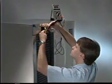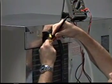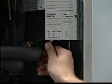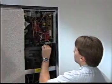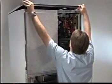The first step in the 10-minute check-out procedure is to make sure there is adequate water and power supplied to the unit. When troubleshooting for system failures, remove the front panel, turn the ice maker off, and remove the control box cover. Now turn the unit back on. Remove the evaporator cover and make sure water is entering the reservoir.